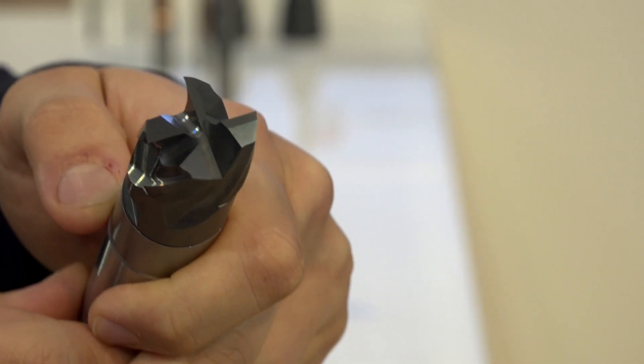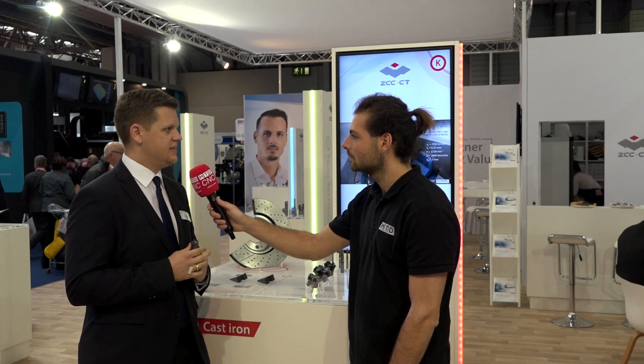That's the cutout of 45 degrees — nobody really wants to ramp at that. How do you do it? There's so much force on the bottom of that end mill — how does that work? We have a special solid carbide which is very tough and very stable for the vibrations in these applications. We have special angles — a very big free angle so we can ramp without problems with pressure. And because of the special form of the chip chamber, we have enough space to evacuate all these chips. So that's the secret.